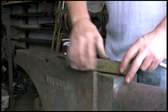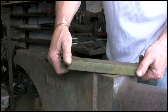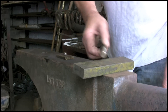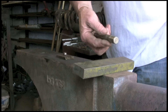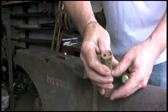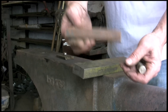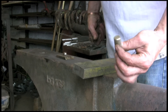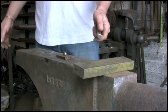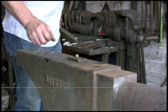And then this bit of two by one flat scrap — I'm actually going to drill a hole through that and use it to make the rivet on. If you've got one of these, the snap head rivet snap or whatever they call them, which is specially designed for it, you don't actually need to make one out of anything, so you can skip that part. But I've lost my big one, so we're going to get this bit hot and give it a go.